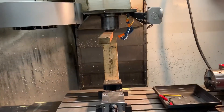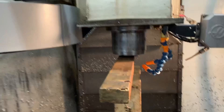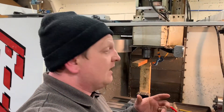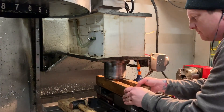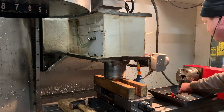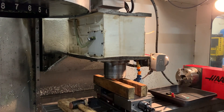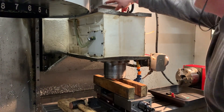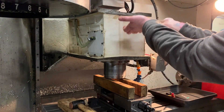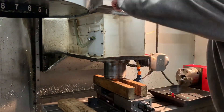There's nothing obvious happening with that collar setup, so the only thing I can do next is lower the head down onto a block, put the vice underneath, undo the bolts, and let the spindle come out. I've lowered it down onto these blocks and I've removed the six socket cap bolts. I forgot to loosen the transmission housing to slacken the belts, so I'm lifting the belts up with my fingernails as I tap the spindle down, using the rawhide side of the copper mallet.